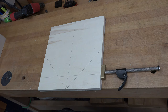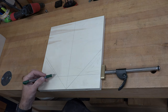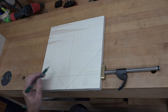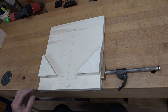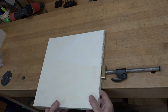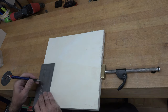That's essentially all the layout for the backboard. Now take measurements of the two triangles you've created on either side of the centerline, and cut pieces of three-quarter inch plywood to the exact same dimensions as those triangles. Those blocks will eventually get mounted here, but not yet. Flip the board over, paying attention to where the bottom is, and at the bottom draw a horizontal line across at the same dimension as your fence height — in my case, two and eleven-sixteenths.